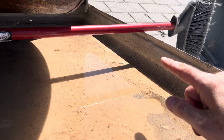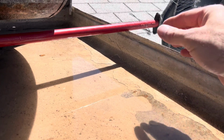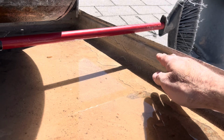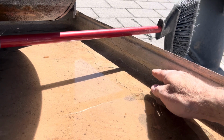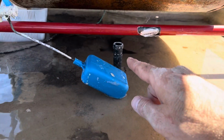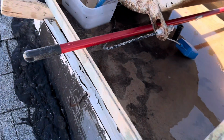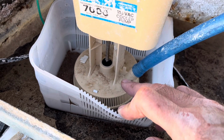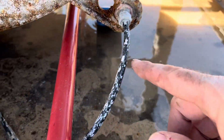Okay? So what you have to remember is that you have to have enough water in here that it's going to coat the pads in water, but enough room left at the top that when the pump turns off, the water is going to drain back out of your cooling media. So the cooling media is going to fill up with water, and when the pump shuts off, like at night when it cools off, the water level needs to have enough room to rise without overflowing either the sides or the center. So you need at least enough water level in the tank to cover your pump right here, at least come over the top of the pump so that it can pump the water. But not so high that when the water drains out of the media it's going to overflow the sides or overflow the center.